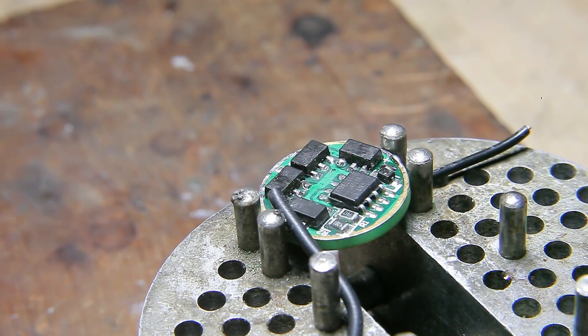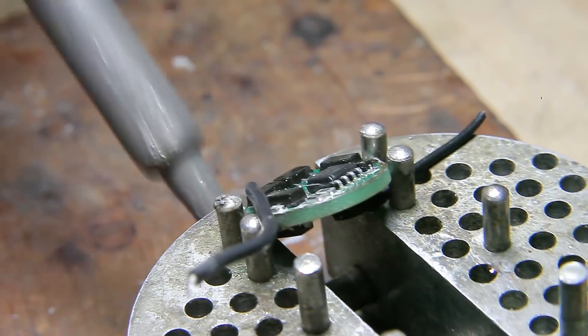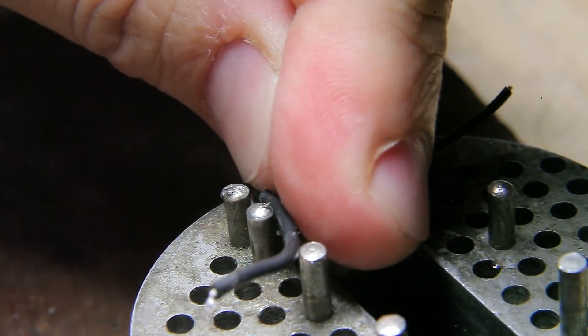When we add those chips on top of that, you'll get 380 more milliamps on your highest mode. It's not going to add 380 milliamps to the lower modes, but it will add a percentage — because the lower modes are just a percentage of the output of the high mode created by PWM. To obtain our extra chips, what I usually do is take dead, burnt drivers that I've got laying around and remove them from those. You can just order them from a few websites though; they're not very expensive.